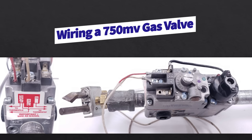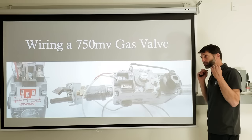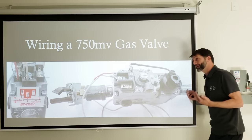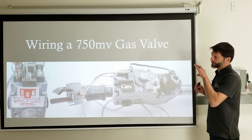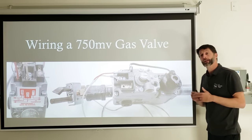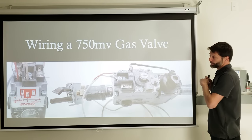When you have a load on the main gas, you should not be dropping lower than about 190 millivolts. If you do, that could indicate the flame isn't enveloping the thermopile, it's out of position, or the thermopile is bad. You really want to shoot for something closer to 250 millivolts when powering your main gas — you need it high enough to mechanically open that solenoid valve.